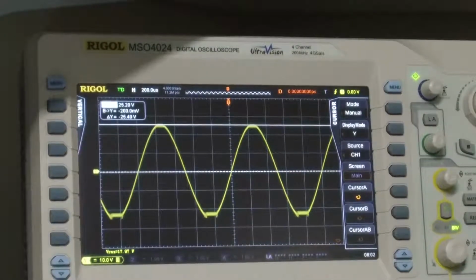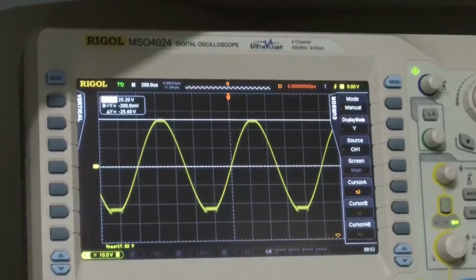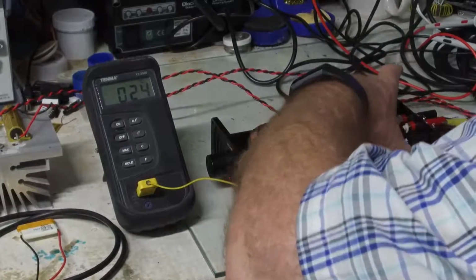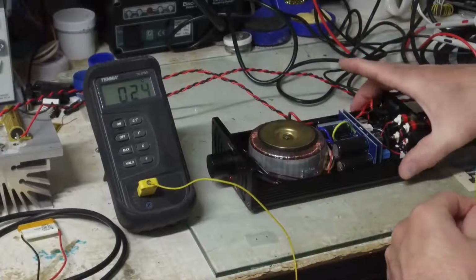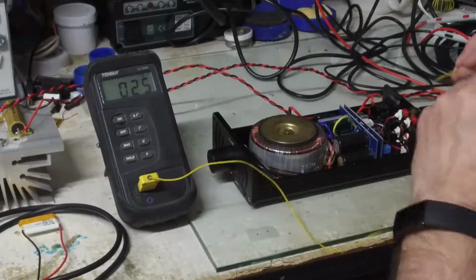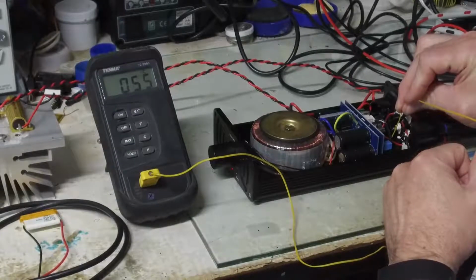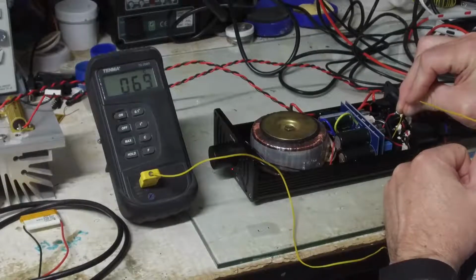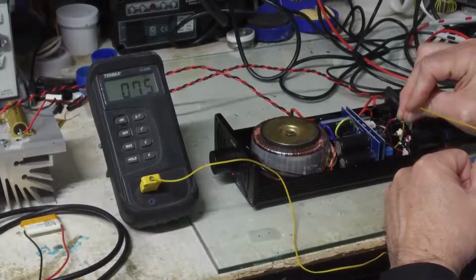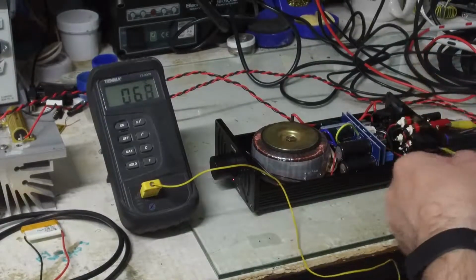We are at 26 volts. Wow, that's really sagged quite a bit. Okay, I just finished those clipping tests, and I can barely even touch the chassis right now for maybe just a second. It is smoking hot, so I don't know. I wouldn't want to keep this on much longer. This is the tab of the LM3886. So here you go.